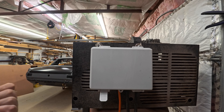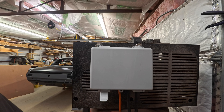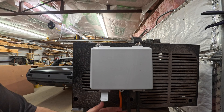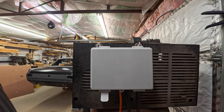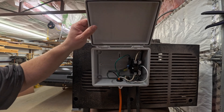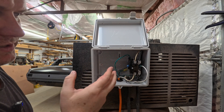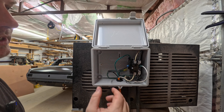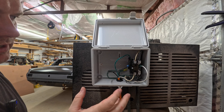I've already got it set up over here. I've got a plastic box — one cord coming out of this box goes to the receptacle in the wall, another cord goes to the compressor, and this cord goes somewhere else. Just a box with a grid in the back. I like these plastic boxes with a grid — one, they're waterproof, they're dustproof, whereas a metal box is generally not. And with this grid in the back, you've got something to mount your relays and other things to. Makes life a lot nicer when you can do it that way.